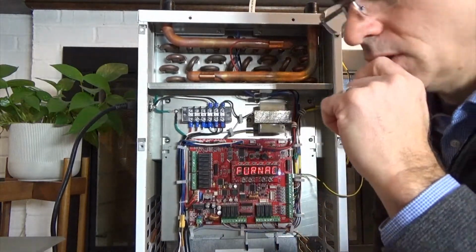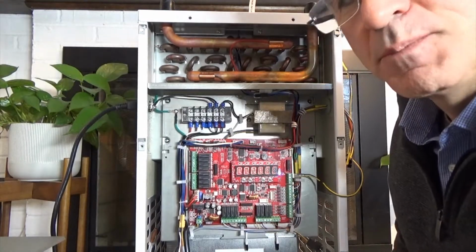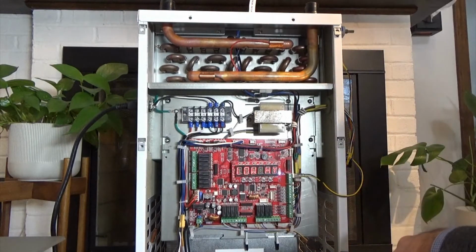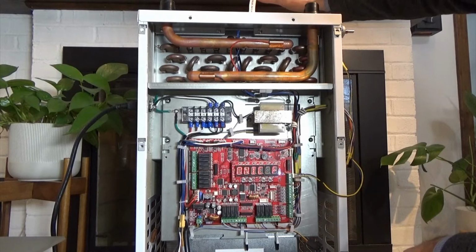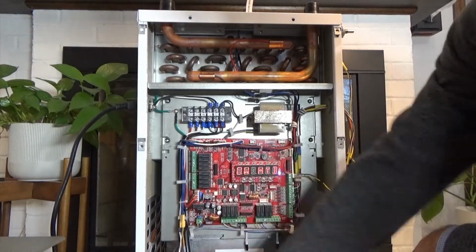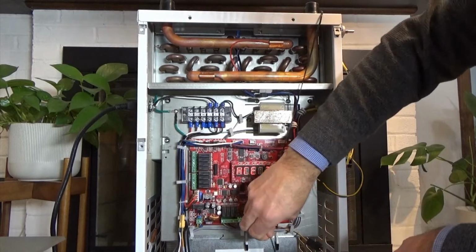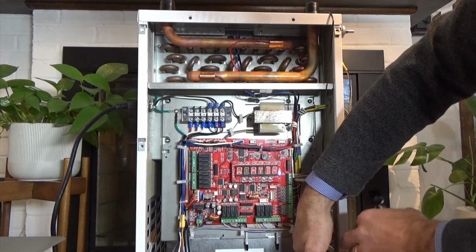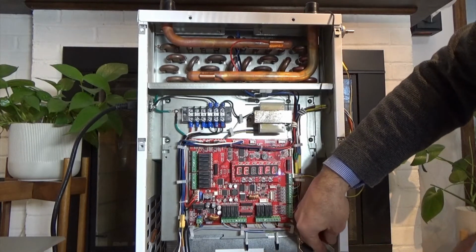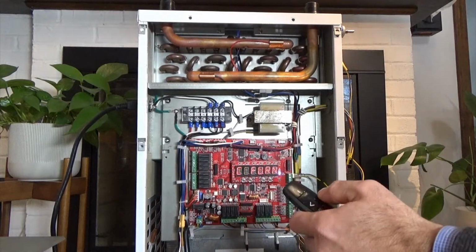And again, when we are using an AC coil on the return, we're going to have to relocate this sensor upstream of the AC coil. So if my AC coil is here, instead of using an A coil, we have the slab coil on the return. We need to take this sensor and move it upstream so it's measuring the right return air temperature, and then we need to move this AC evaporator sensor closer to the actual coil, but downstream of the AC coil. So your AC evaporator temperature sensor is downstream, and your return air temperature sensor is upstream of the slab coil.